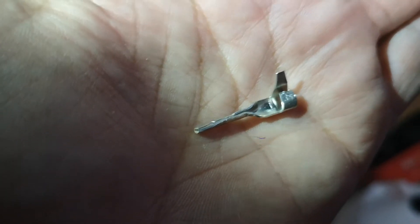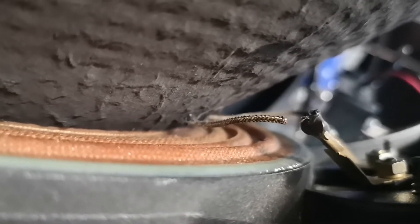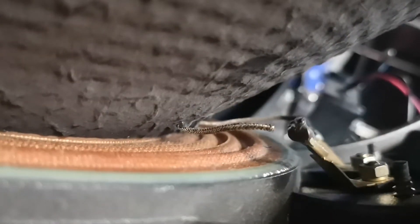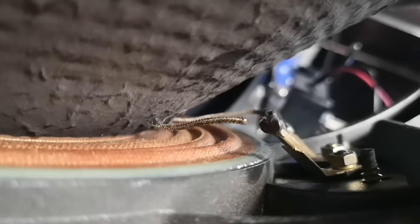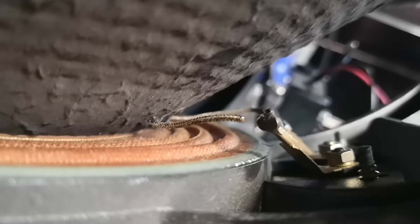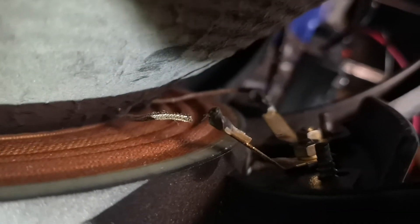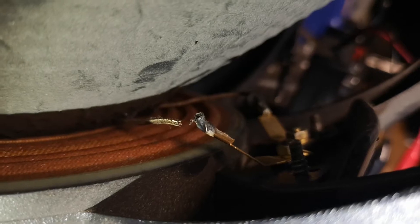The reason I want to clamp it is because, due to the nature of this cable, it's difficult to solder something onto it. Normally, you pass it through the post, put an enormous amount of solder on there, and clamp it into the post — that's how it holds. I don't feel comfortable just trying to solder a cable alongside that; I'm not sure how well that's going to hold. I basically want to make a little crimp extension — I just don't have any crimps, so I have to make one. I'm going to clean this post up, clamp onto there, bend it, and add the little extension.